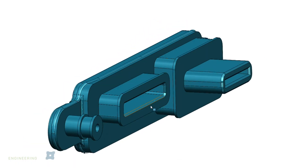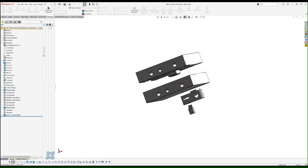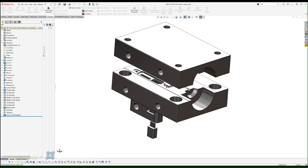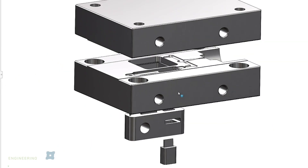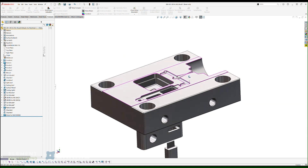The problem with that is that you can't actually machine this and it becomes quite a complex little mould. The 3D printing should have allowed us to basically make these undercuts directly in the 3D printed mould, but the conductivity is just not where we need it to be. We've gone ahead and tried to make this in a way that we can manufacture using CNC machining, trying to machine this from five sides using the five axis.